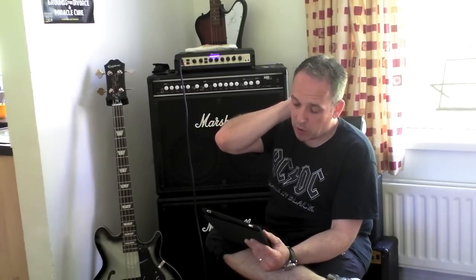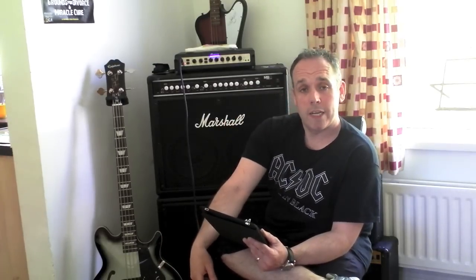Right, here's some figures for you to save you going away and looking them up yourself, because I love you so much. I'm doing all your legwork. First of all, the ultra-low switch. When you have that switched in, you get a low-end boost at 40 Hertz. So very, very low. If you imagine the human range of hearing is around 20 hertz to 20,000 hertz, or 20 kilohertz, at 40 hertz you're right towards the bottom of the spectrum. So you get a 2 decibel boost at 40 hertz with the ultra low switch engaged, but you also at the same time get a 10 dB cut at 500 hertz.